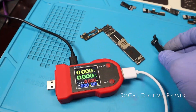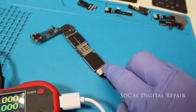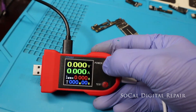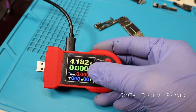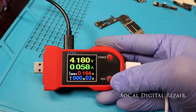I've actually removed the shorted capacitor from the board, so it should be fixed now. As you can see, it's pretty simple to use — you just plug it into the board. Essentially it's a battery connection and the charging port connection. Now let's see what happens when I click power. Nothing happens — you get the 4 volts but you get 0 amps. That's good. Now you click test, this prompts it to boot, and it looks like it's booting.